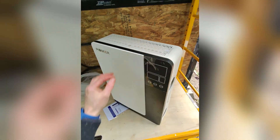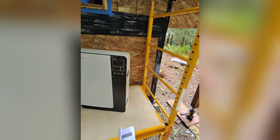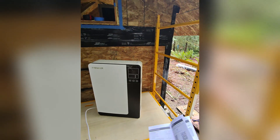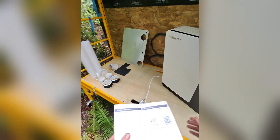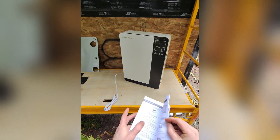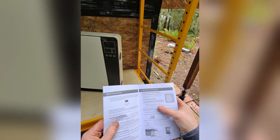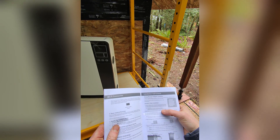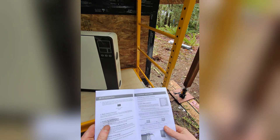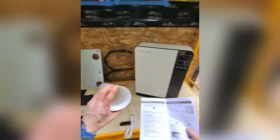You can install it either with side inlet and outlet, back inlet and outlet, or a combination thereof. I'm going to go ahead and use the back. It does recommend installing it with the ventilator bottom five feet from the floor. I won't be able to do that, but I can do one foot from the right or left side. So I'll go ahead and pick a location, then mount some mounting blocks for where these tubes will come through.